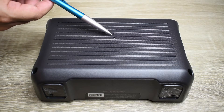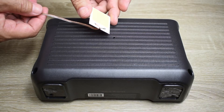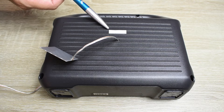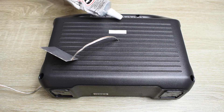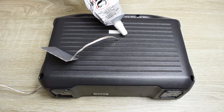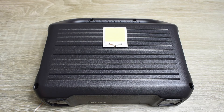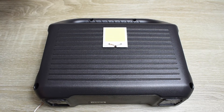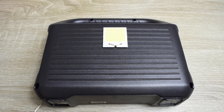The next thing I did was drill a one-eighth inch hole right in the center of this panel in the right location for the wires to pass through. You can see a very narrow strip of double-stick adhesive was applied to the surface after rubbing alcohol. Then I'm going to take the E6000, apply a bead right here and below it. This is what it looks like when it's bonded in position. I'll put a little bit of clear nail polish over those connections and that's it — let that dry.